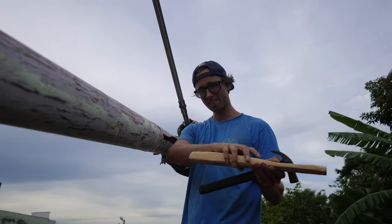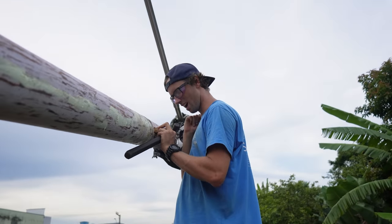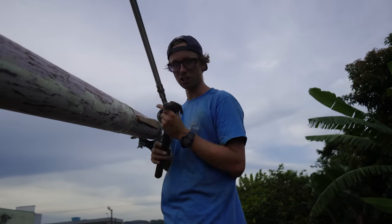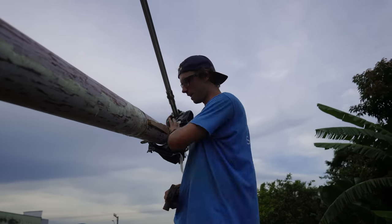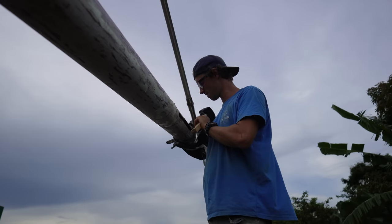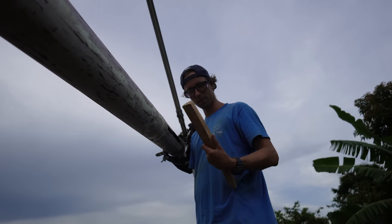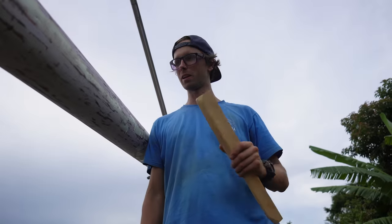Then I'm going to cover this with as much resin and Cabosil as possible, stick it in there, hammer it in, probably strap it on with a rope or clamp it, let it dry. This is sticking out loads, but I'm just going to go over it with a grinder, sand it all off, it's nice and round. Hope for a sunny day. Maybe even dry it with a heat gun and get that epoxy in. Better not lose this, it took me forever. Then we can paint this. And P wants to do a crazy colored bowsprit. I don't know what color yet, but she wants the boat to be normal-ish, but this, crazy.